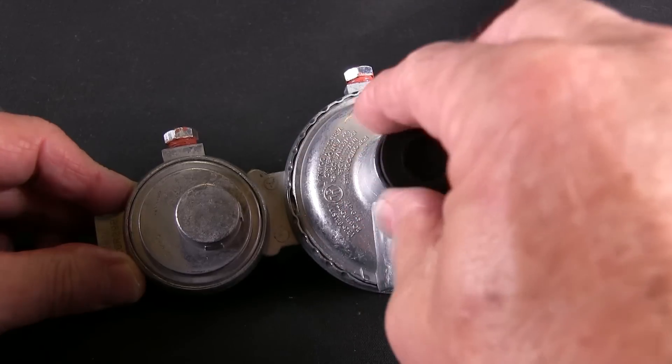When a burner is lit anywhere in the system, the drop in pressure inside the regulator body allows the spring to push the diaphragm back down. This in turn allows the linkage to move the seat away from the orifice, permitting more fuel into the body of the regulator. As more fuel enters, the incoming pressure again overcomes the spring strength and the seat again blocks the orifice opening. As more fuel is consumed at a burner, the pressure drops, the diaphragm moves, the seat opens, and the cycle continues.